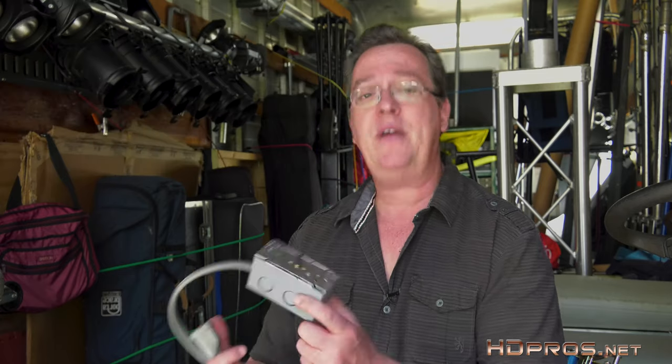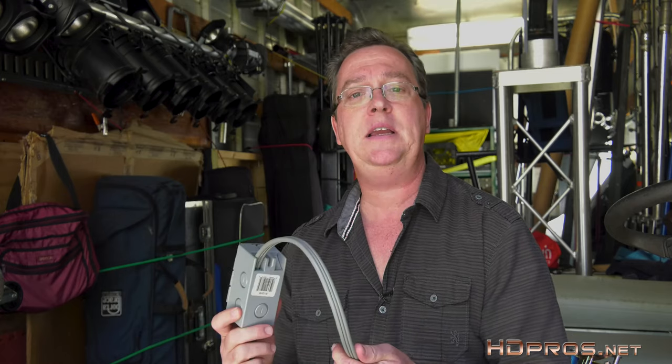Keep in mind, a squeezer will not work with a spiral fluorescent as they cannot be dimmed. Also, many LEDs can't be dimmed. Some people use streaks and tips to spray the bulb, but I am most often working on corporate sets and want to leave the set the same way it was when I arrived. I don't want to spray paint the client's light bulbs and later have them wondering what that smell is and why the light is so dim and smoking. So head on down to Lowe's and grab yourself a dimmer and a conduit box and a couple of leads like this, and you'll be in business for just a few bucks.